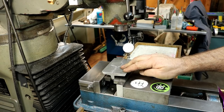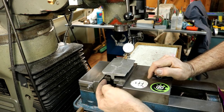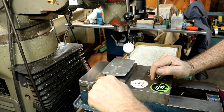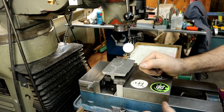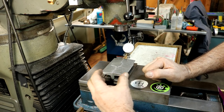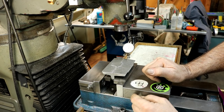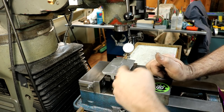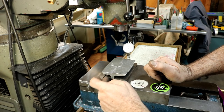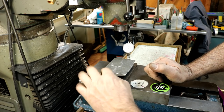That way they could be larger on the sheet. I have the base mounted here on the milling machine. And what I did is I have a parallel up against the reference surface against the fixed jaw. It's a thick parallel, half an inch thick, so that holds it pretty much perpendicular with and parallel with the fixed jaw. And then I threw another one in here, and that's resting on the face where the cylinder goes. This is the important side right now. And then I just threw one in here for it to sit on, give me a little bit of height.